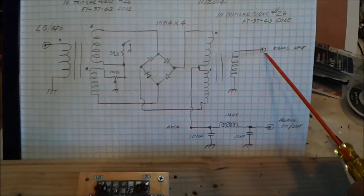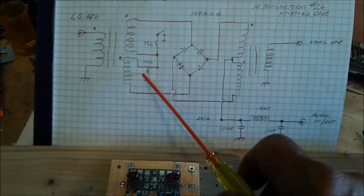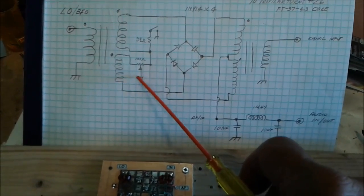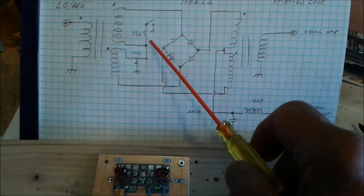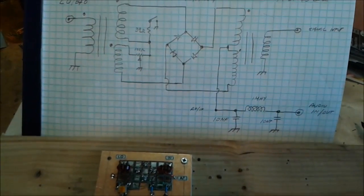The signal input is at this port right here. We had talked about in one of our prior videos about adding the 100 ohm pot for balance, that's here. We'll also add a 39 ohm resistor with a switch that's currently not on the board, but that will enable us to unbalance the balance modulator to produce a signal for tune-up.